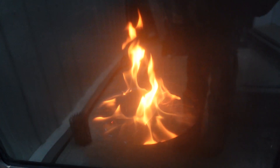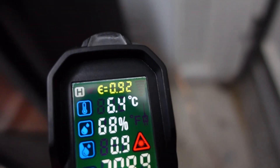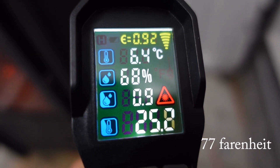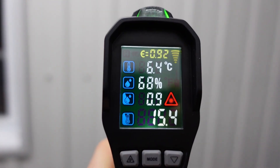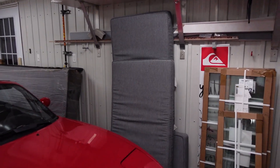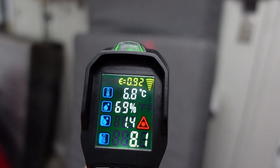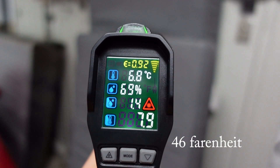So we have our first 20 minutes. I just want to show you the flame so you have an idea of what it looks like with the heat type — it's not the blue flame we're looking for but it's getting there. The top of the stove is at 209 degrees Celsius, the side of the stove is 25 degrees, the wall beside is roughly 15.3 degrees, and the cushion at the other end of the garage is 8 degrees Celsius.